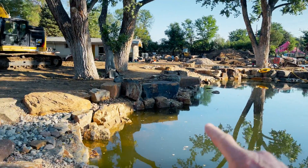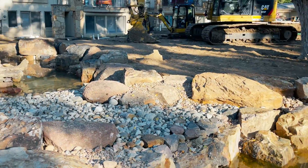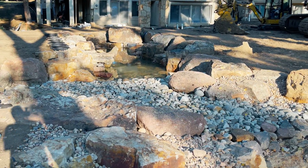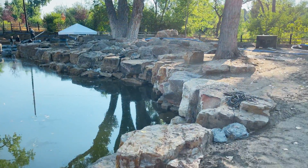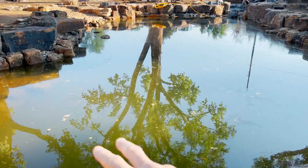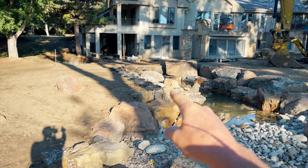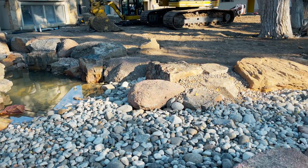There's the footprint. The water level comes up almost four more feet to the bottom of that stone. This is our giant skimmer system. All water from this entire feature pulls through in this direction and goes back in here. We've got two pumps that go all the way back to that giant mound of dirt back there, a pump that runs this waterfall, two pumps that run the jet system through the entire water feature, and three pumps that run our wetland filter up at the top. All of those pumps suction from right here — that's what creates the flow and makes our skimmer work so well.